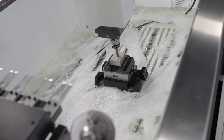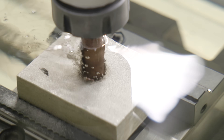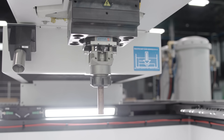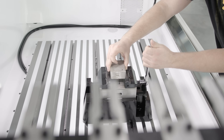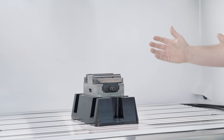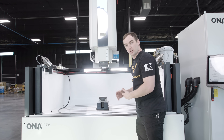What's different about this machine from a mill or a lathe is it actually uses electricity. You put a tool holder into the head of the machine with a copper or graphite electrode, put your workpiece down, and the head comes down and burns features into your part. It also has a C-axis in the head, so instead of flipping your block over you can just rotate that C-axis, which adds a lot of versatility.